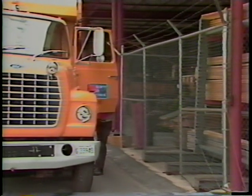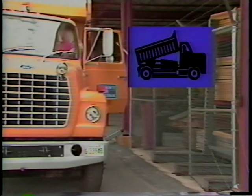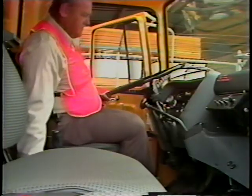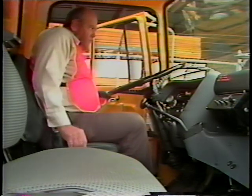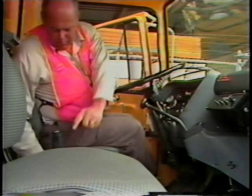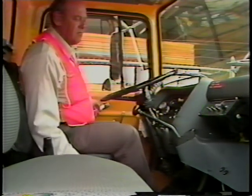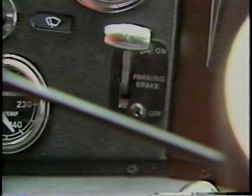In the last segment, we finished our pre-start checks. Now let's go on to the second activity, the equipment warm-up check. The equipment warm-up check is carried out in the parking area. It helps ensure that the truck will perform as it should during its daily use. Before starting the engine, make sure that the transmission is in the neutral or park position, that your parking brake is set and the clutch is depressed if so equipped.